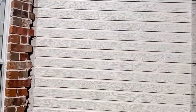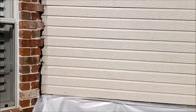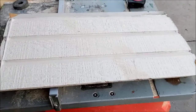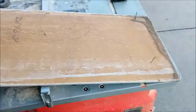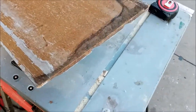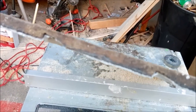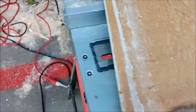You've got Masonite siding on your house and it's either water damaged or termite damaged, and you can't buy this anymore - how do you handle it? In the early 80s and 90s, Masonite siding was a preferred product to put on the outside of houses. It was budget-friendly, which means it was cheap. They say it's made from wood products, but technically it's made from compressed paper or a paper-similar product and resin or glue, then compressed and heated to get the texture on the outside.